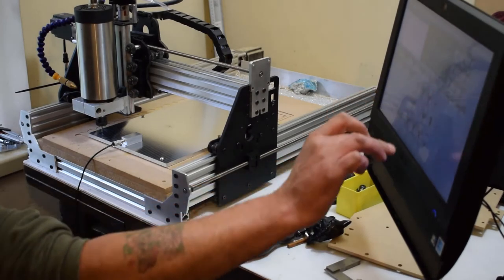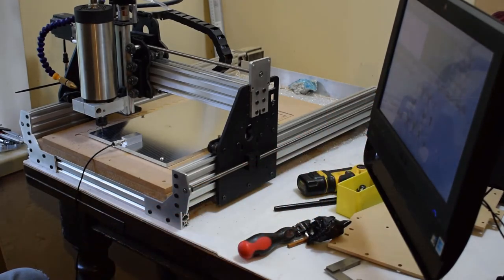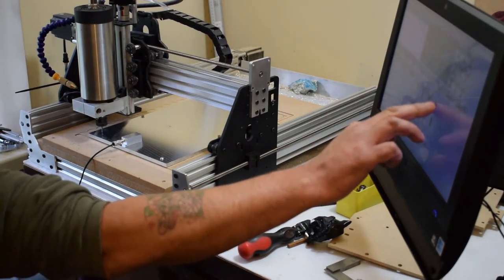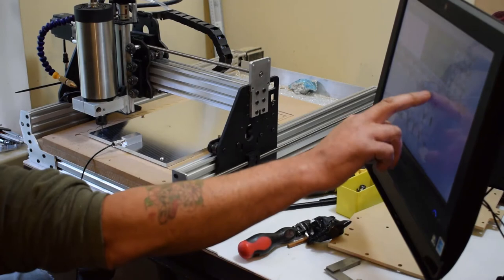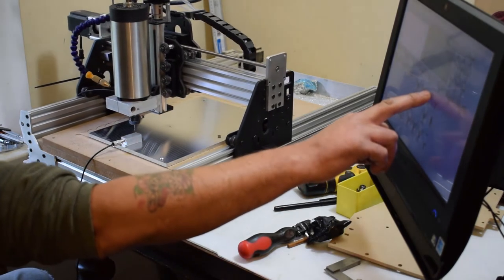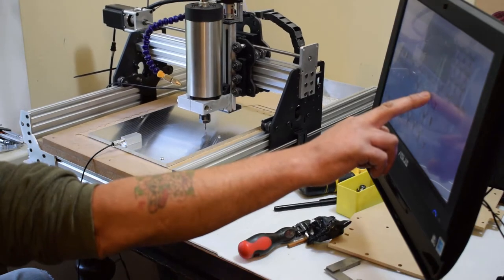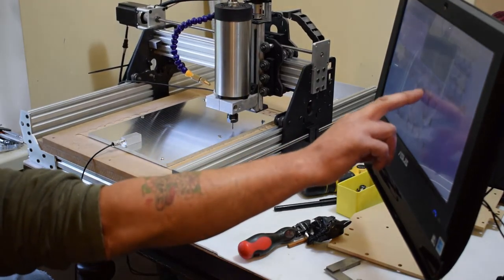So got first aluminium plate. It's now all loaded. One thing I like to do is check my Z reference from corner to corner. I normally do it in each corner plus the center, just to see how level we are.